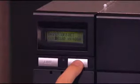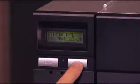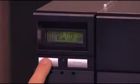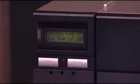After enabling advanced mode, use the feed key to scroll through options. Once you have decided which option you want to change, utilize the line key to change the option and then cycle power to save.